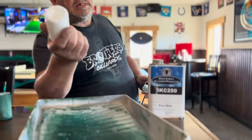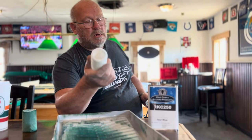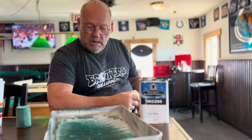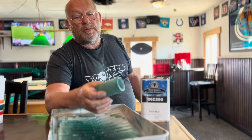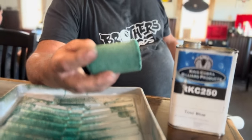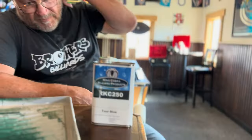Glue. 3/16 snap rollers. Not 3/8, not 1/4 inch. 3/16 snap. This is what they look like when they've been used. Okay, turn it with your hand. Yeah, there you go. So we're not wasting glue and we're not soaking it through the cloth. If you're doing valleys, then you should get 7 to 8 real easy once you become proficient with the glue.